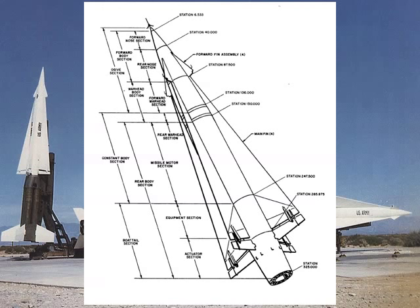Here's a little bit more of the missile. I can tell you that this photo is for a nuclear missile — they're very carefully not calling attention to it, so I'm not either. It's got basic sections of the missile and pieces of it. The forward fins are there not because it needed them for center of pressure or stability or aerodynamics, but to support the four antennas and some pitot tubes for measuring barometric pressure. There was one antenna on each fin so that as the missile rotated during its flight, there would always be an antenna in range of the missile tracking radar. If it didn't have an 'I love you' pulse from the missile tracking radar every 10 milliseconds, the guidance and control unit would fail safe and destroy the missile.